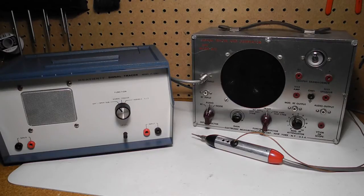Signal tracers are a type of electronic test equipment used for radio and amplifier servicing. When using a signal tracer, the service person would trace a signal from the antenna through each stage of the radio in turn until reaching the speaker, or in the case of an inoperative radio, the faulty stage. The other common method of diagnosing radio faults was to use a signal generator to inject signals, starting with the final audio stage and working back to the antenna until the fault was found. An oscilloscope can largely replace a signal tracer, but is much more expensive, so many hobbyists did not own one.